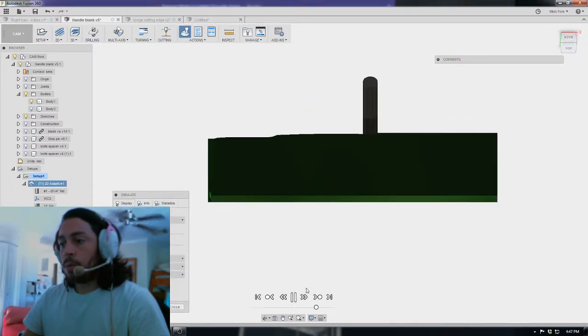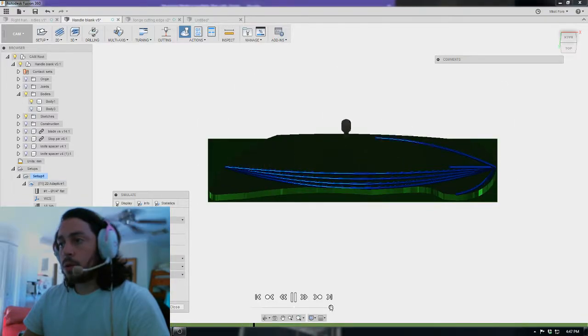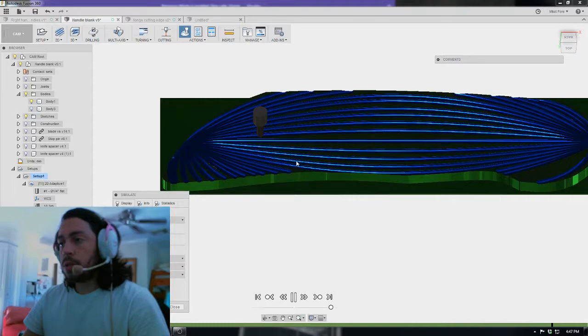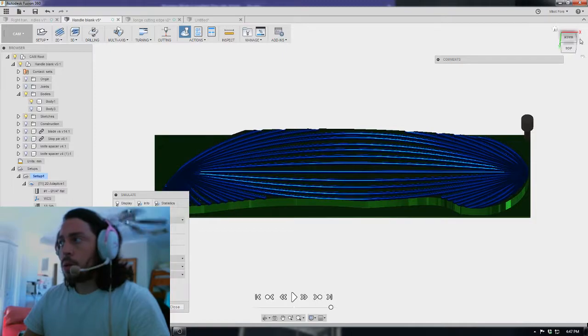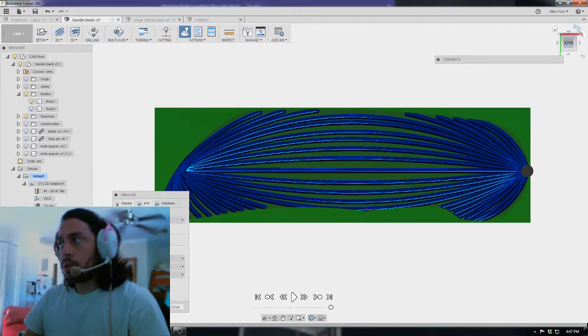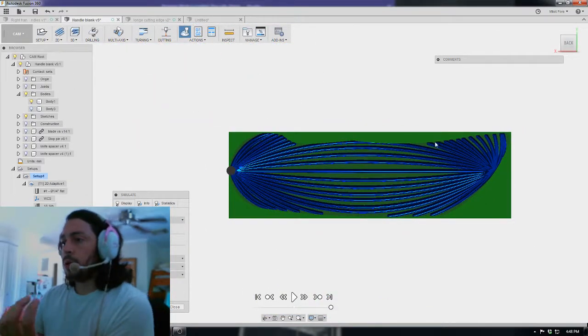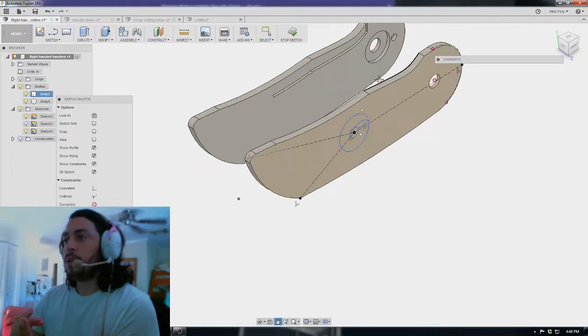So I just did an adaptive real quick, with no finishing pass or anything, just to get the shape to show you. So this is the pattern that I was looking at doing. I think those are about half a millimeter or a millimeter deep into the actual final stock, because there's still some offset from the adaptive. It wasn't a finishing pass. So they're actually really light cuts into it, and I don't know whether to go more or less. But I imagine that would look really cool holding it in a hand. If you notice the example, I accidentally made it left-handed. I have a right-handed, I'm making the flower pattern on the right-handed handles.